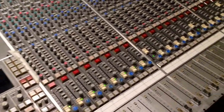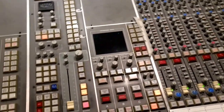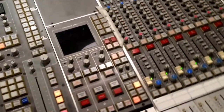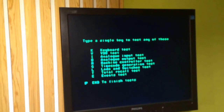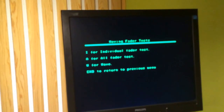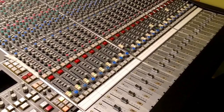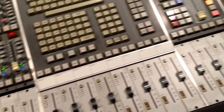On a final note, there is a quick way to test if all faders are working as expected and to see if any faders might need attention. To test all faders, enter the test menu, go to 'Analog Output', hit O for 'Moving Fader', then hit 'Wave'. All faders should be moving in a wave — none should be sticking to the top or the bottom. If any are sticking, you have a problem.